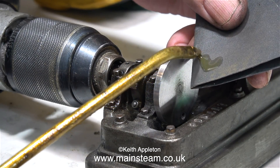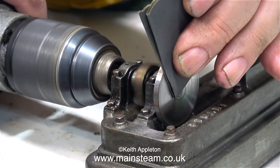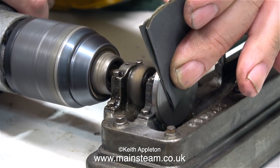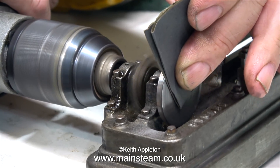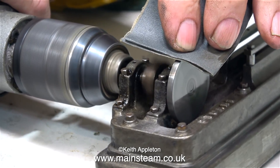Most of these bolts on the main bed plate of the S50 steam engine are dummies that are cast into the main bed plate casting. But at some stage in the life of this engine, someone decided to fit proper bolts into the main bearings, even though they don't split. And if you look closely, you will see that one of them is cracked, so I will have to give this some attention before I start to paint the engine.